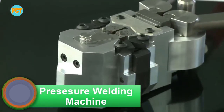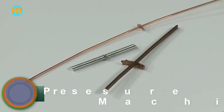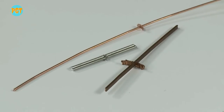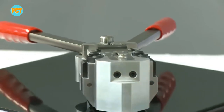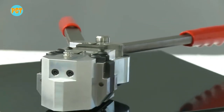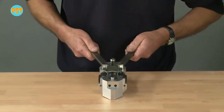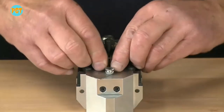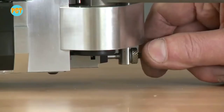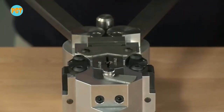Pressure welding machine. This machine is currently the smallest machine of its kind, which welds non-ferrous wires ranging from 0.30 millimeters to 1.80 millimeters in diameter. It has been carefully designed and balanced so it can be comfortably handheld and operated, or fixed to a peg on a work area. To do the welding, carefully insert the die into the machine and adjust the gap.